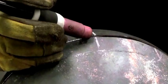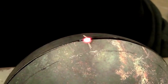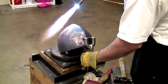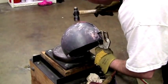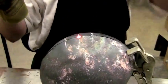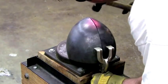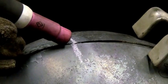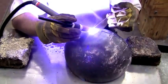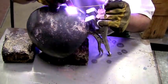Here I'm tack welding the two halves together. I know that this isn't necessarily a historical method of doing a helmet, but this is a cost-effective method and since I'm usually doing this for a client, the result for them is negligible — they don't mind that I'm using modern welding. I do have experience raising these helmets from a single sheet, it's just that that's not what I was going to be showing in this video. So here I'm tack welding the two halves together, using heat and a hammer to close up the gaps and match everything up as closely as possible. Once those tack welds are in place, I'll run a more complete weld, but at this point it's just to keep everything held together.